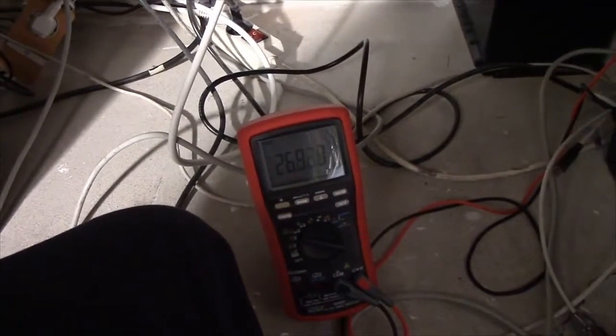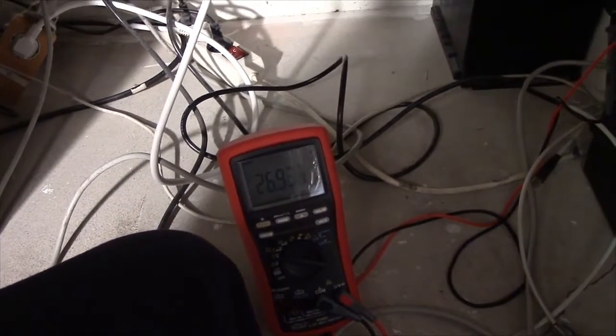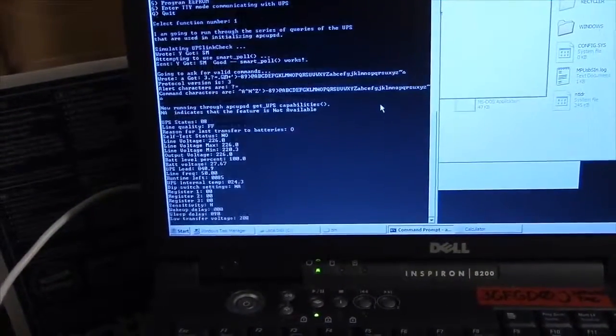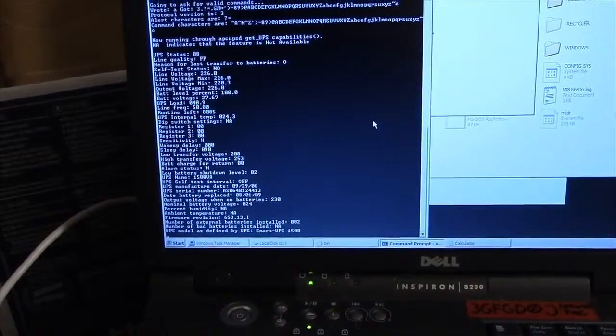There we go, isn't that fancy? The cable is just as long as it needs to be to reach the batteries — no unnecessary losses. The last cable essentially went round one or two times before going to the batteries, and combined with a bad connection at the clamps, that probably didn't help too much. I also raised the float charge voltage on the UPS because I realised that in my ignorance I had set it way too low. Moving on from that embarrassing detail, let's see what this thing can do. I've got the APC test loaded, and let's see what kind of runtime I think it's going to get with my 500W lamp connected.